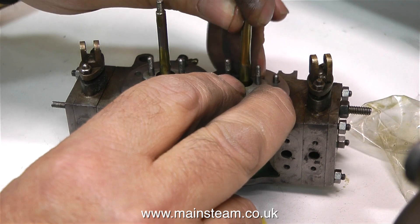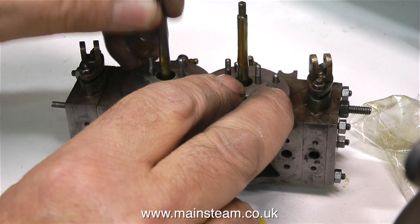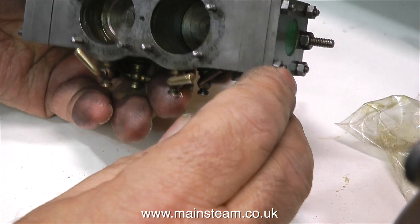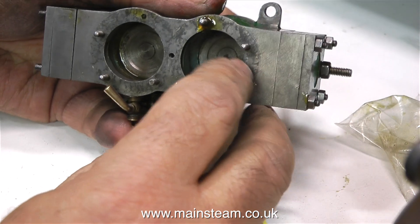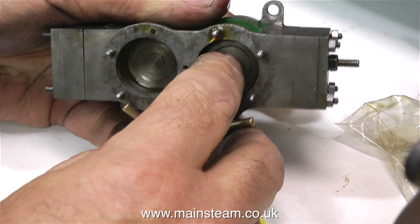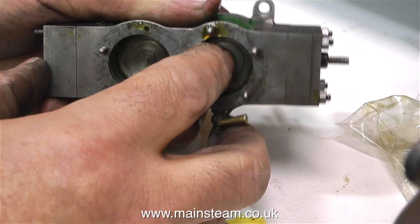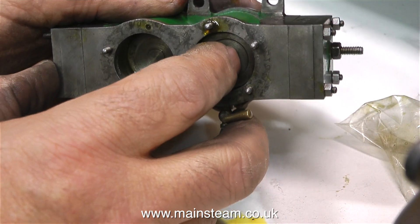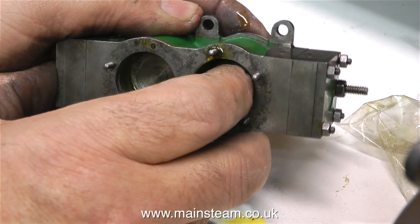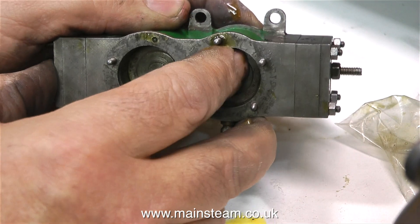There is some resistance because these cast iron piston rings are pressing against the wall of the cylinder, and the enlarged hole in the gland area is also allowing the piston rod to move from side to side. But all in all this feels okay — from my experience I don't think I'm going to have a problem with this. The previous builder must have had a problem though, and that's probably why the lug's broken — maybe he threw the part across the room in disgust. When I press the pistons from the other end using my finger in the bore they're also very very smooth, so this is definitely successful.